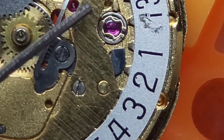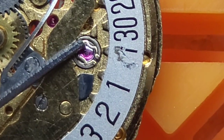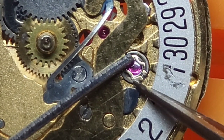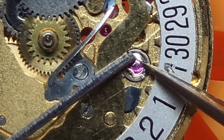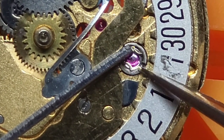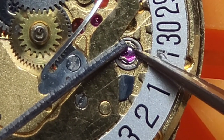I did the exact same thing with this shock setting — the last one: took it apart, cleaned it, new drop of oil, two halves together, and now I've dropped it in there with probably just the same amount of fuss as before. I'm just dropping this cage clamp back in — one side is in and then the other side follows. This is something new for me — lubricating a watch, especially with all these special Mobius lubricants. I already know I should have put some on the underside of that date wheel. I was once told that over-lubrication is probably going to be more harmful in the long run than under-lubrication — and I think I've probably taken that to its very limit and under-lubricated.